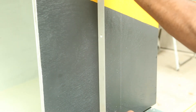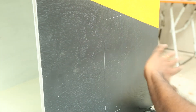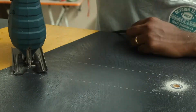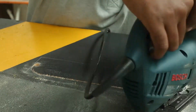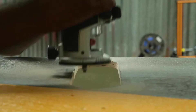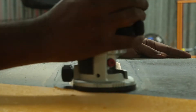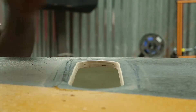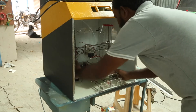Using a straight edge I mark where I need to cut the hole. It has to be wide enough for the Z axis to slide up and down. Then using a jigsaw I cut into the plywood. I rounded off the edges to give it a good feel. Now I can slide the 3D printer in diagonally and it will drop into place.